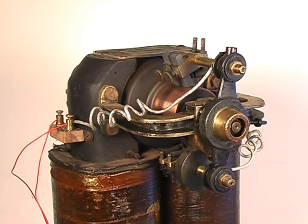We let the motor accelerate to full speed, then turn the armature power off. Notice the motor runs really fast at 30 volts, and when the armature power is turned off, the voltage only drops off slowly. This is because the motor now works as a dynamo while slowing down.